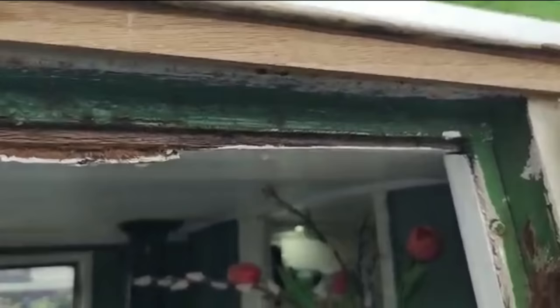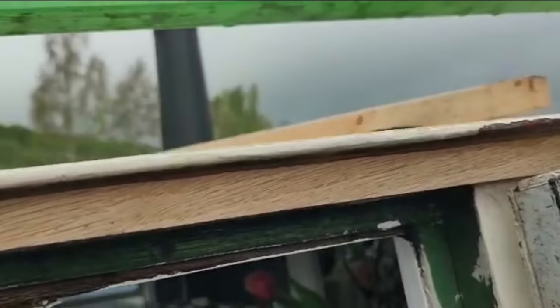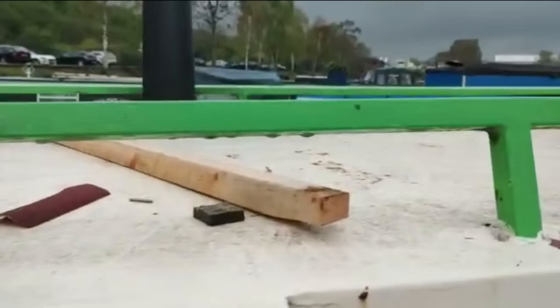I did this oak trim last night, actually before I finished. It's got a drip section there, which is a hell of a lot closer to the doors when they shut than what we did have, because the problem was also rain getting in through the top. So I've got this small gap there now above the doors with a drip there as well, instead of the more or less 25 mil gap that we did have, where the rain could come in at an angle and get on top of the doors, and that was creating a problem.